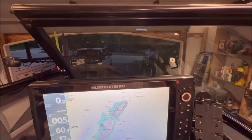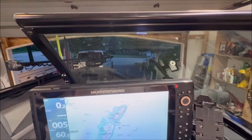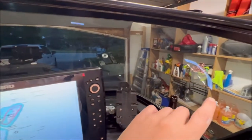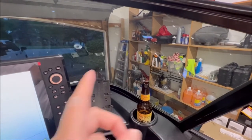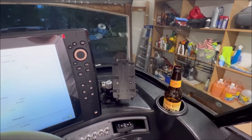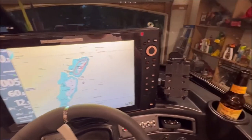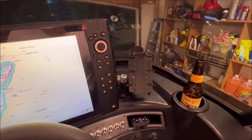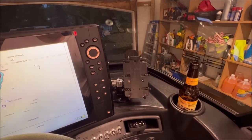Leaning over a little bit, I can see just about everything, and sitting back I'm just missing a little bit of the gunnel — no big deal. Much improved visibility. I've got a little eye issue on the right side, so having this extra visibility is really important. Without the gauges here, I don't have a fuel gauge or tachometer, but I do have VesselView Mobile for Mercury, so I'll have that on the phone right there. I'll get GPS speed, tachometer, fuel, and different things from VesselView Mobile.